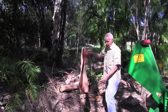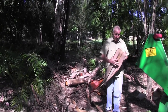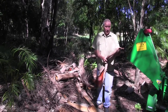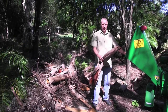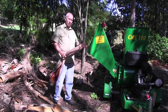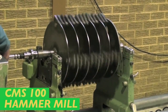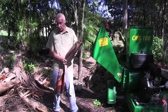These are large Alexander palms. This one is a little dry at the moment, but I'm going to attempt when I start the machine to roll it up. You can roll it up to about the size of the throat of the chipping section of the CMS. This is the advantage of the CMS100 — it has a chipper and a mulcher and a hammer mill. You can chip this to a manageable size and then put the rest of it into the mulcher, as I'll show you.